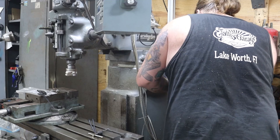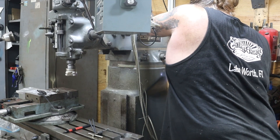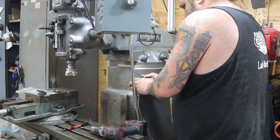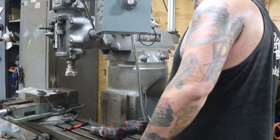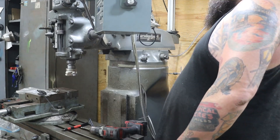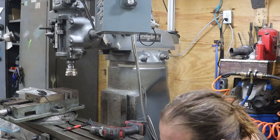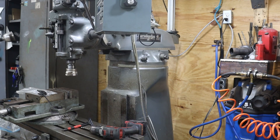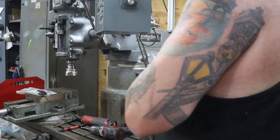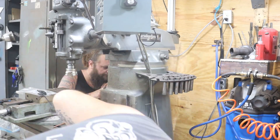We got the mill wired up and in position. Now it's just time to install some accessory stuff. Right now I'm drilling the base for our collet rack — same collet rack we had on our other machine. Quick couple of holes, quarter-20 tap. Cast iron base drills and taps real nice, not hard at all. Then we'll go ahead and get our collet rack bolted on with a couple of quarter-20 screws. On the other side we have our tie-down clamp kit — same thing, couple of quarter-inch holes, drill and tap, and get those bolted on.